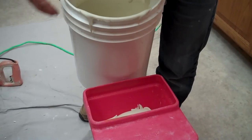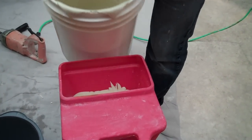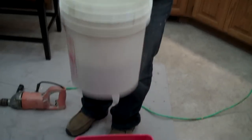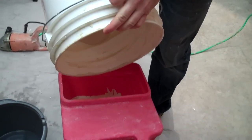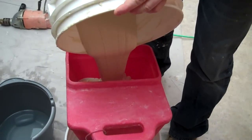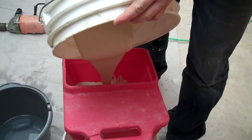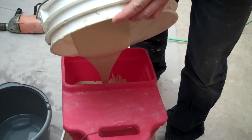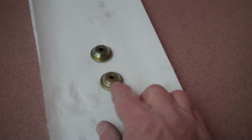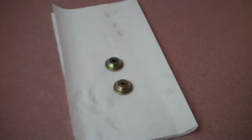When you go to make the next batch, it should pour out the same way. This is the consistency you're looking for — it should be pouring right out into your hopper, the same consistency all the way through. You can use your ends right here. Right now I have the largest one on. Here's your small one, your medium one, and the large one just one size bigger. It works great for the Mediterranean knockdown which we have here.